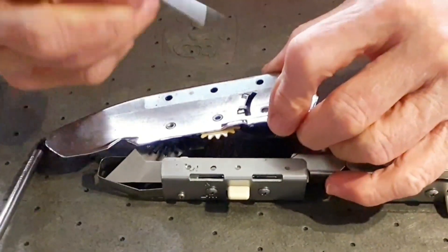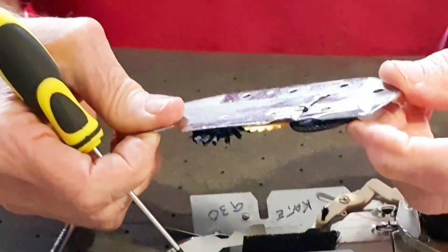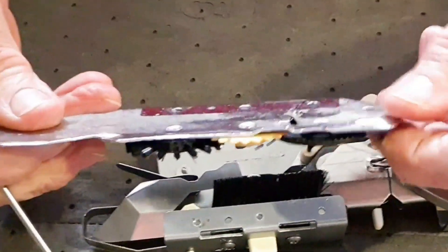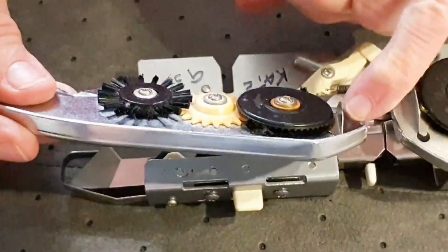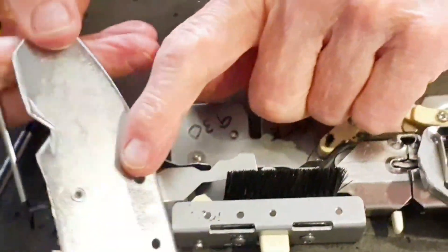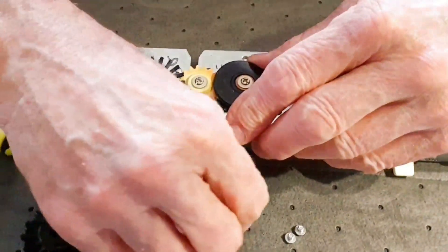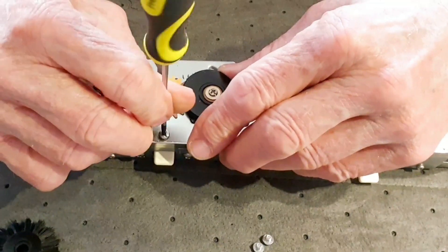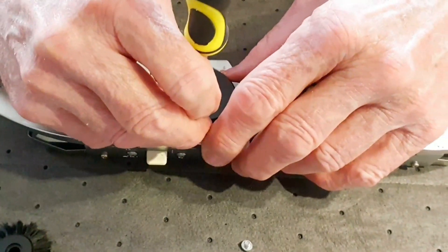This is also a spring that must be properly aligned — that's to move this rubber wheel in and out. When this is off, you can lose the alignment of this end of the spring. So be careful that when you get it off, you make sure it is in position. There's a tip right here that is over a hole when it's locked into position, so lock it into one position and make sure it stays. You can see the footprint of the wing mount for this. Put it on — three screws, start in the middle. This is a useful thing to know because sometimes these wings get bent; new ones are actually still available and you may find yourself needing to change out these pieces.